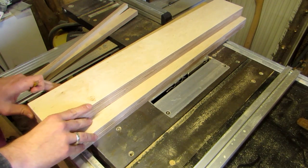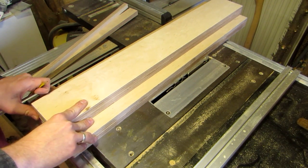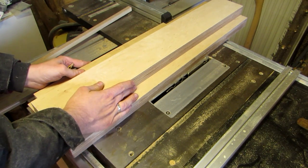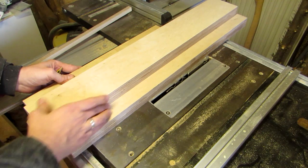When you use two different pieces to make matching dados, you also need a piece that is as wide as half the difference between the two pieces — you will see what I mean in a moment.